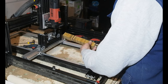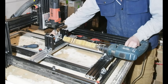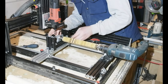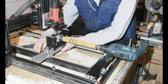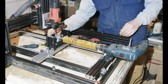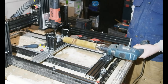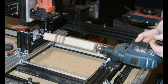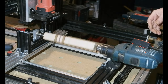Not really knowing what I'm doing or how it would work out, I opted to glue dowels into some pieces for the chuck to hold onto. You can see here on the benchtop there are a few chips laying around. You will in a minute see my genuinely first attempt at turning with this machine - the setup footage I filmed later, but it makes sense to show it first. Typical setup really: tailstock slid in place to meet the workpiece and tightened down with the thumbscrews. I decided to go with screwing down the L-bracket supports at the front too - belt and braces until I get used to using it. I used the tailstock adjustment to apply some pressure for secure work holding. Despite its tiny size, this mini tailstock will telescope a full 40mm. Although my old B&D drill has a power lock-on button, it doesn't have a speed adjustment dial, just a responsive trigger, so to keep it at a manageable speed I use a clamp for the trigger and apply pressure until I'm happy with the speed. Not ideal, but works for now.